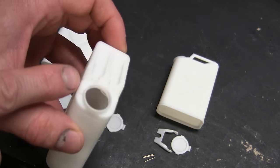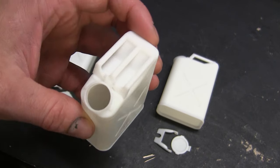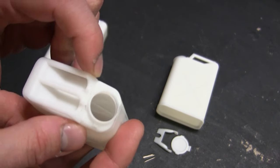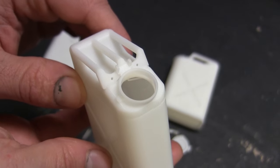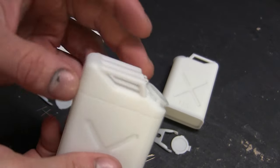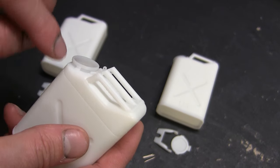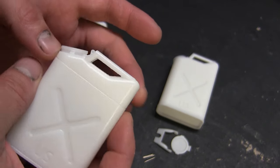The grab handle is integrally printed onto the can — the type of detail you can really only do with 3D printing. It has all the appropriate detailing found on the real unit. The handle is a single piece of sheet metal stamped multiple times to get the appropriate shape. On the back portion there's a spine, and on the front a flat plate crimped on the ends. The half-round cutouts also have crimping detail, and there are two holes — on the fuel can these mount a retention chain, but on the water can they're unused.